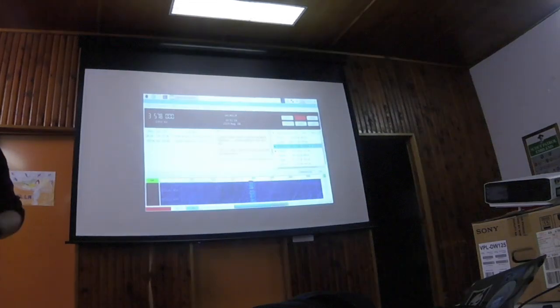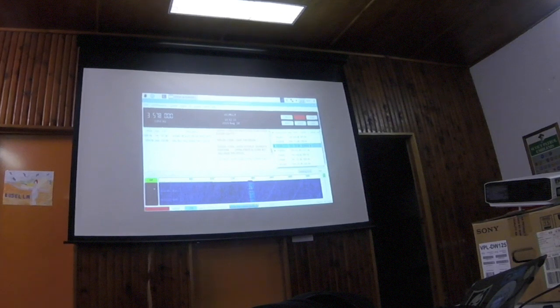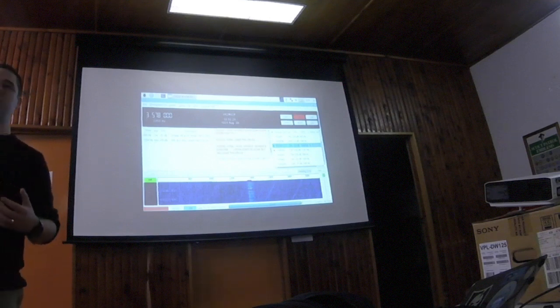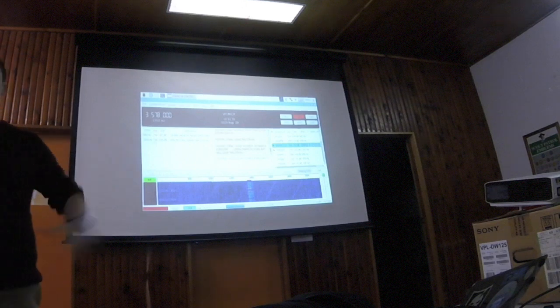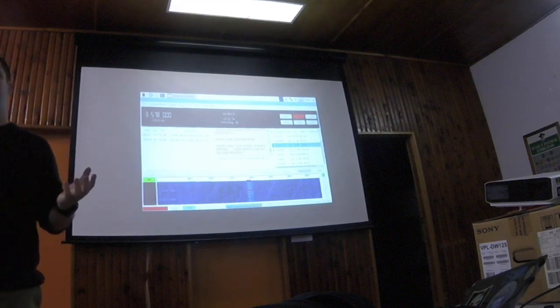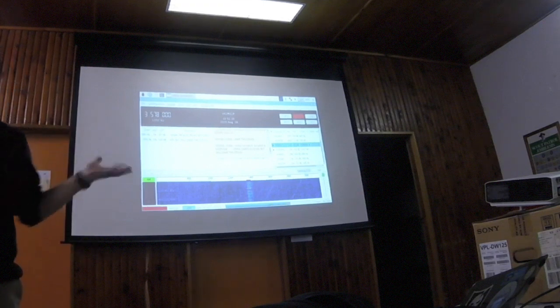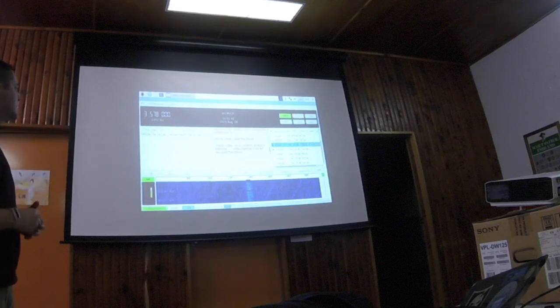In the earlier beta versions you used to have to use CW-like indications such as BK, etc., to say I'm now passing it back to you. But to save frames, because God forbid you actually had to send another 15-second frame just to say BK, that's why Jordan introduced that EOM indicator, which you can set to whatever you want. All of these colours are actually customisable too. There's people everywhere that have different vision ability, so you can change the contrast colours, you can change the indicators to red, etc.